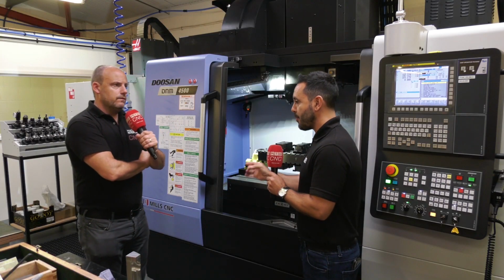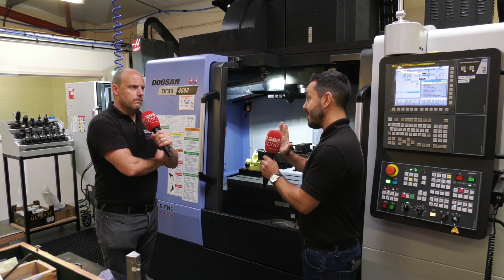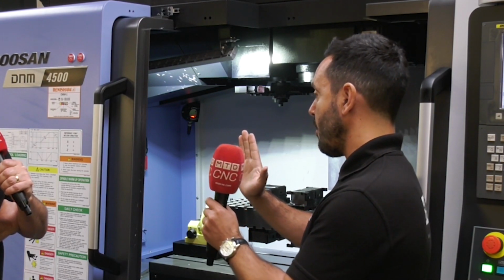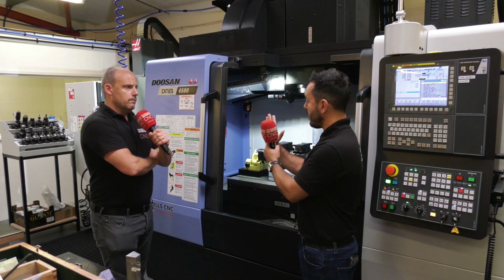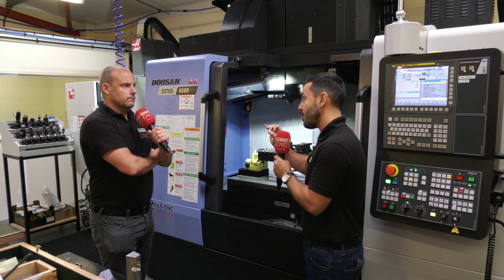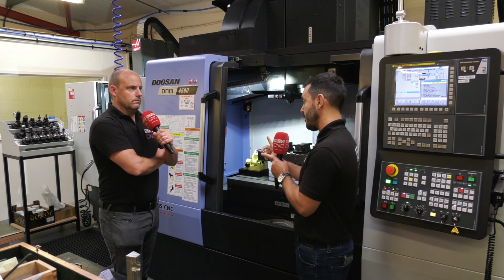When you have particular work holding solutions and you're not holding that part securely, for example 1960s technology, a solid fixed jaw, you'd have deflection in that fixed jaw. So effectively you're only holding the part at a pinpoint. You're not holding the part down the face because the jaw is at an angle. Subsequently you'll get vibration and chatter on your part, and to overcome that you'll have to do one or two things.